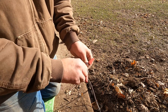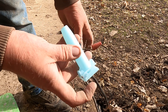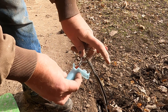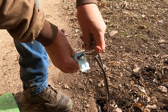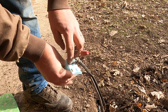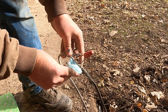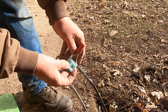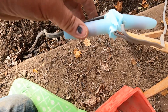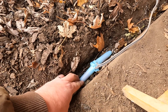I'm just going to twist these grounds together. All right, so now I've got it twisted together. Of course, black to black, white to white. I've got the ground twisted. I'm just going to open this up — the silicone is already in it — and just shove it in. The silicone does come out a little bit, so I just want to put that back together. I'm going to put one wire on one side, one wire on the other, and I'm going to close it up. There it is. I'll do the same on the other side. Okay, so they're both in. I just kind of put them top to top and then ran the wires. Now I'm just going to put them in the ground and cover them up.